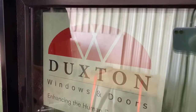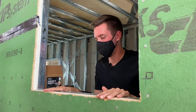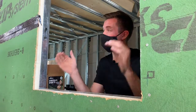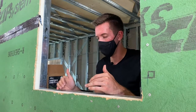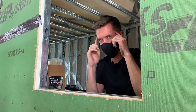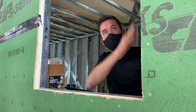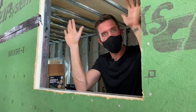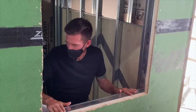Now I'm going to show you step by step how to put one of these in on our tiny house. The number one thing you have to worry about when installing a window is water. You need to make sure water can't get in, and if it does, it can get out as quickly as possible without carrying into the rest of your structure. The first step is to prepare your window opening — for us that involved drilling at the corners and cutting out the square after the sheathing was put on. After that you need to prepare your sill surface.